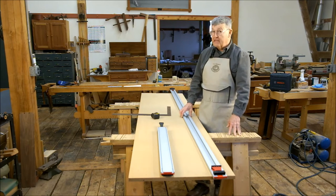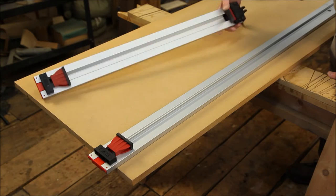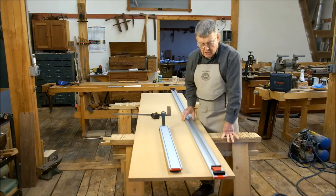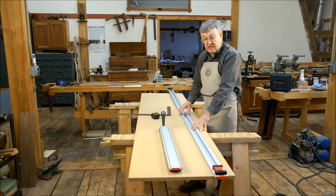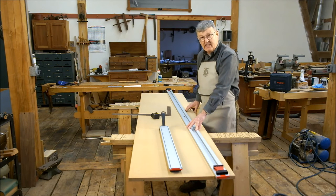The basis of the system is the WT-X Trax themselves. The first one is a small track that spans 25 inches, great for small cabinet pieces. The second two are each 50 inches long and may be used individually or joined together. The individual track will span 4 feet, while together they span a whopping 101 inches, much more than the 97-inch length of this piece of MDF.